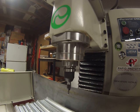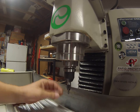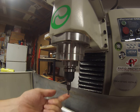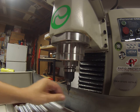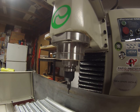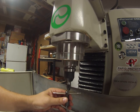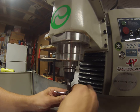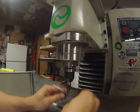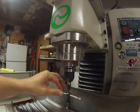I've got a little tapping head in here — this thing's just a spring-loaded tip. It basically helps you keep centered on your hole and gives you some spring pressure to push it into the hole. I jogged it over a hole, set it up, and set my height offset to just below so that when I get it in there, there's some spring tension — it'll hold itself in there.